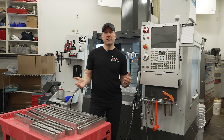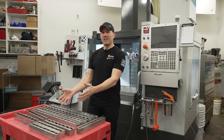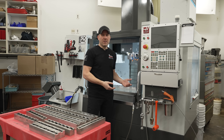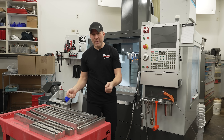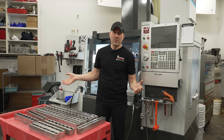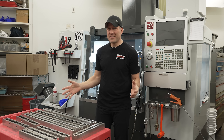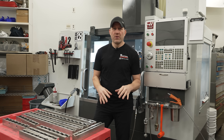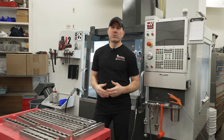Pallets would probably be better to use because when you have a pallet, you can load out here. The next thing is when you load or unload the machine is stalled - the machine is waiting for you to take them out. Sometimes it can go real fast and it's not that crazy, but it is nice to be able to have a pallet, lock it in place, shut the door, press go, and then undo it, blow it off. So you're saving time there. This was just something I needed fast - cheap and it's the best way to do it. What I would do later on is make sure I had an offloading system that was quick load.